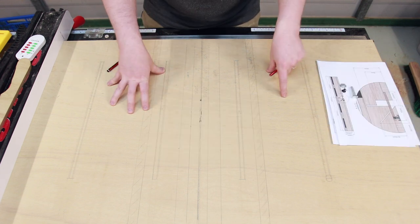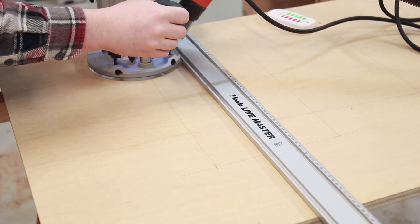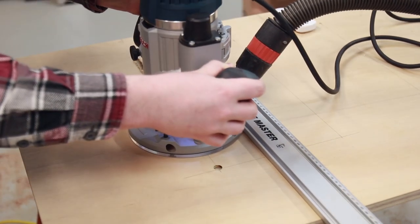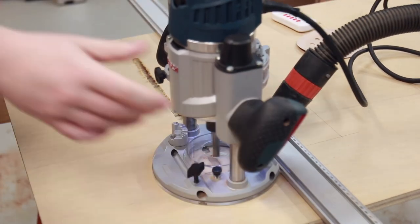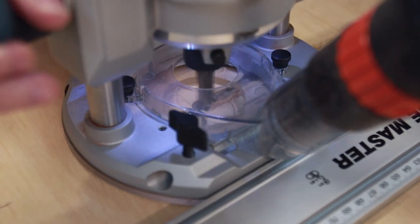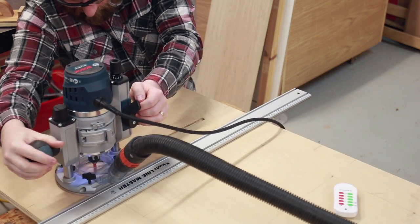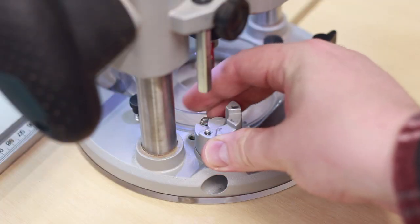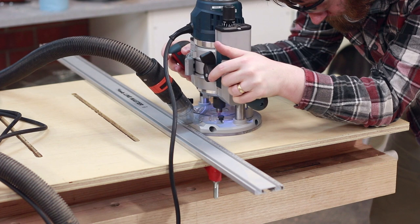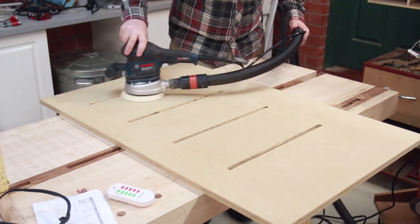The first thing to do to the base is to cut these grooves, for which you need two router bits: a half-inch bit and a 5/16-inch bit. Using a straight-edge clamped to the workpiece I started with a half-inch spiral up-cut bit for a groove just barely deeper than the thickness of the bolt head. Spiral up-cut bits going across the grain isn't ideal and it resulted in the router getting stuck — I had to grab sandpaper to clean it up. One end of the groove gets a half-inch cut all the way through to allow the bolts to slide in. Then I moved to the 5/16-inch cutter, plunging no more than half the diameter of the bit per pass, which works out to about 4mm. Using the turret stopper it was easy to batch that out. Afterwards I sanded the underside with 180 grit to get it silky smooth so it glides better.